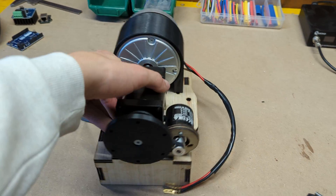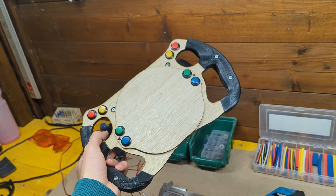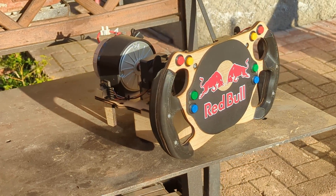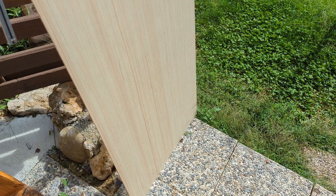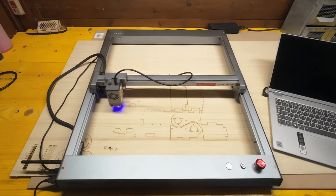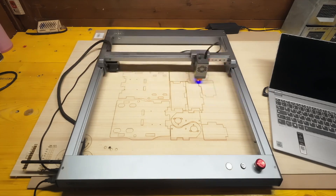I will cover everything from building the wheelbase, connecting the electronics and constructing the F1 style steering wheel, to hopefully get a setup comparable to $1000 ones for a much cheaper price. Everything will be built out of 4mm plywood sheets, from which the various parts can be cut using a laser engraver. Like for the pedal set, you can find the PDF plans in the link below, as well as the DXF files in case you want to cut them with a laser engraver.